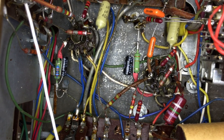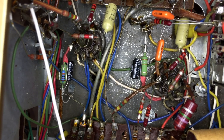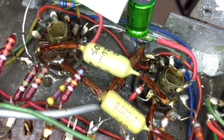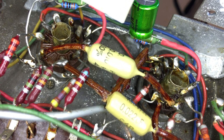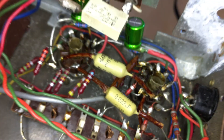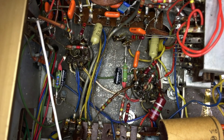On those two single-ended cases, we now have 170 ohms with a 10 microfarad bypass capacitor — good quality capacitors. On the push-pull pair we have 170 ohms with 47 microfarad bypass capacitors. All three sections have been carefully and neatly resoldered, contrary to what was done before — all fixed up and recovered.